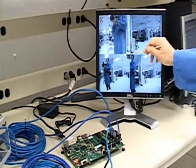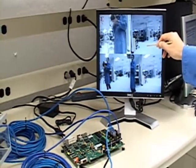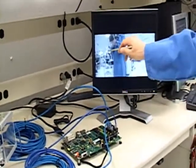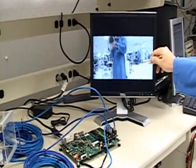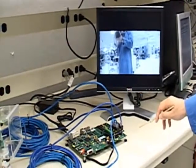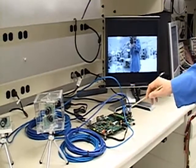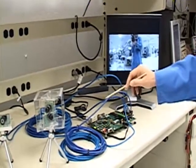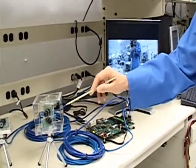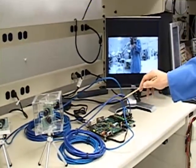I'm going to show you a mode which will combine images from cameras 1 and 2, creating a composite image of those two together. In this mode, we're taking cameras 1 and 2 and combining their image feeds. The FPGA is actually controlling and synchronizing two of the cameras together, using our bi-directional control to send information across using I2C to our deserializer, then creating a virtual bridge to our serializer which is connected to these two cameras. These cameras are sent simultaneously with the high-speed video and the low-speed control information, which is synchronized from the FPGA processor.